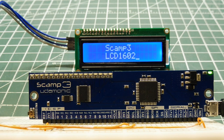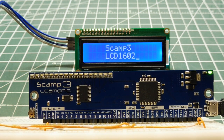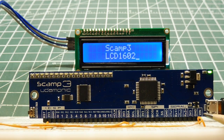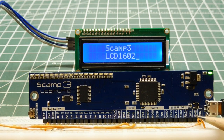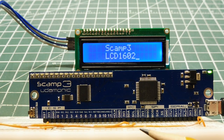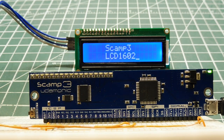After the modification of the I2C piggyback board, the next step is to hook it up to the SCAMP3 board. We'll run the I2C scanner and see if we can pick up the new address of hex 0x23. There are only four wires: VCC and ground, and the two I2C bus pins SDA and SCL. We're getting 5 volts off the VIN pin, which gets 5 volts right from the USB connector. Then we run the I2C scanner to check for hex 0x23.